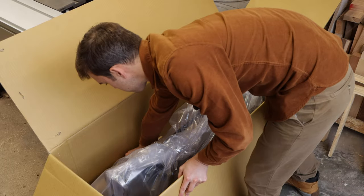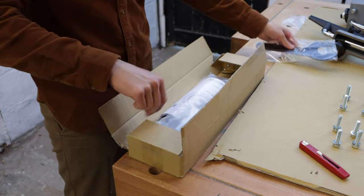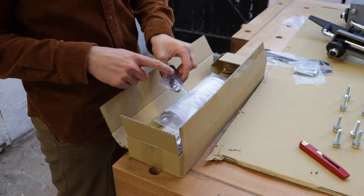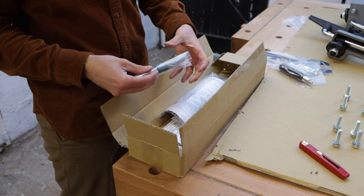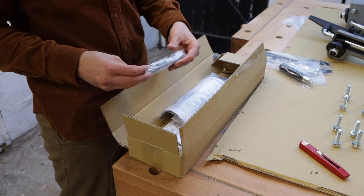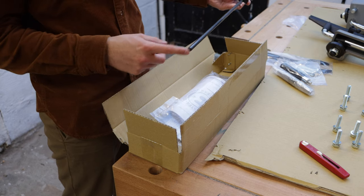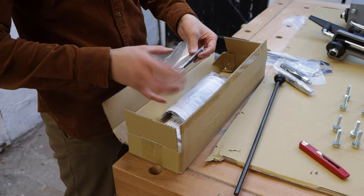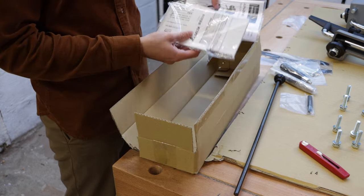And you've got this box at the bottom here. In this box you've got a spanner that's for taking the faceplate off, some bolts, this handle that I think is for tensioning the belt, this is one of those double end tapers that helps you centre the tailstock and the headstock, this bar that you put through the headstock to help knock out the spur centre, this locking key that locks the headstock so it's easy to remove the chuck, and you also have the instruction manuals.